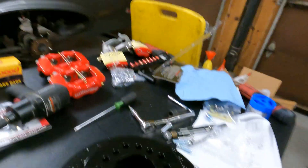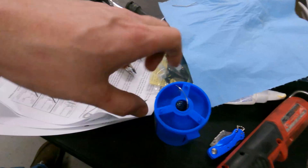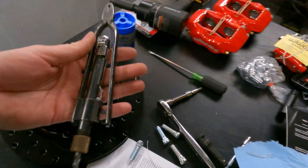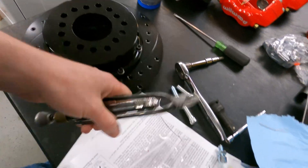Welcome back to the garage. I'm shooting on one of these new GoPro 9s, so let me know what you think. Hopefully GoPro has finally created a camera that even my shaky self can hold and vlog with. Today we're going into safety wiring. We have our two-piece drum and rotor, some .032 aircraft grade safety wire — about $12 for this stainless wire — and my trusty but beat-up safety wire pliers. This is the smaller size; they do make a larger size.